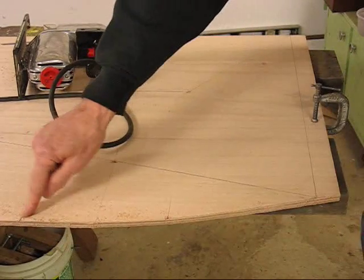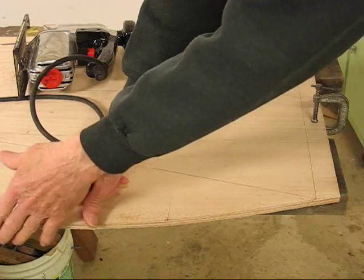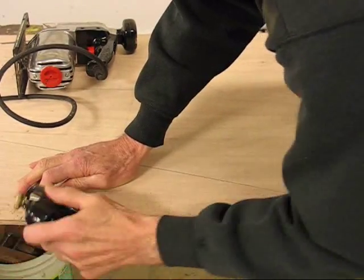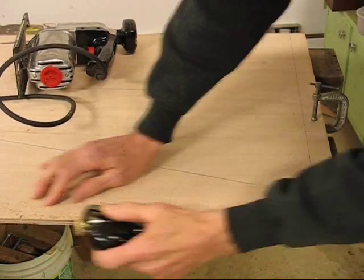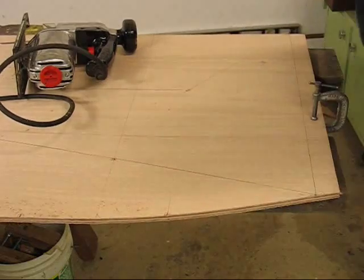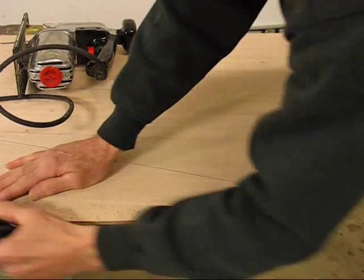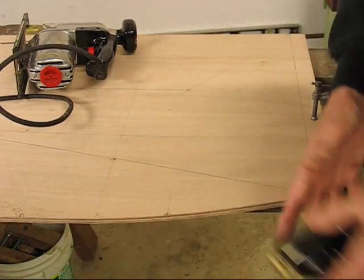This one's just a short length because between here and the very stern end on this bottom keel section of the panel is a dead straight line, so there's little to do to that one. I've got the little block plane out with not a lot of blade sticking out. It's a low-angle plane so it does better on end grain. Just take your time.